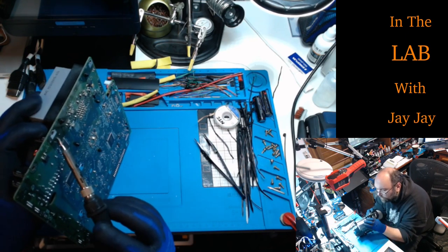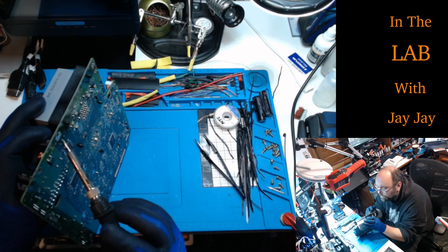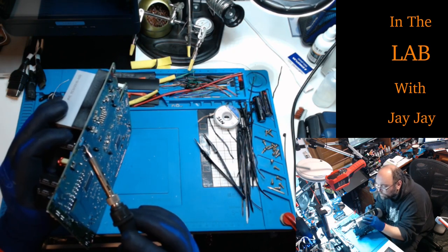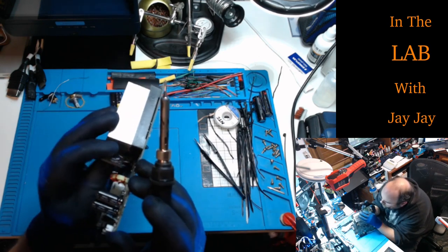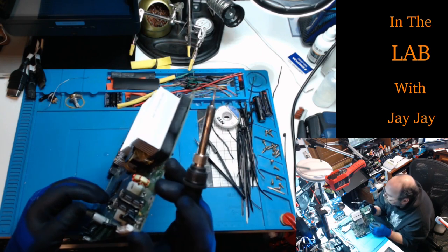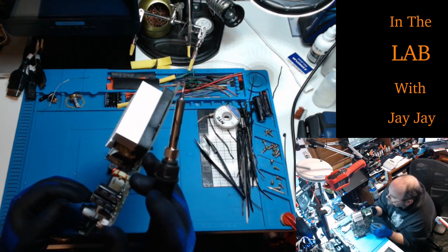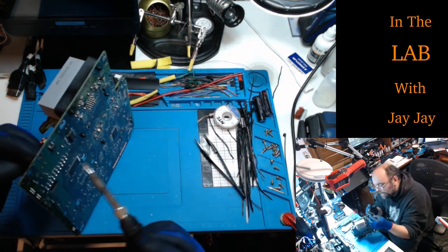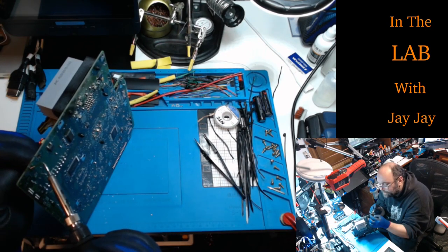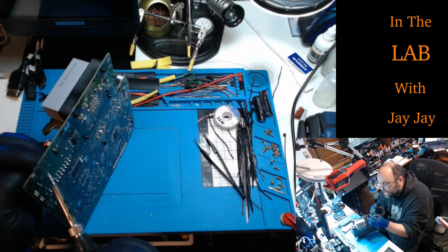And him out, he's going okay. There we go. And the white side is negative. Now, I'm pretty sure all of these are 3,300 microfarads at 6.3 volts. Now I believe that these power caps are what they call low ESR.